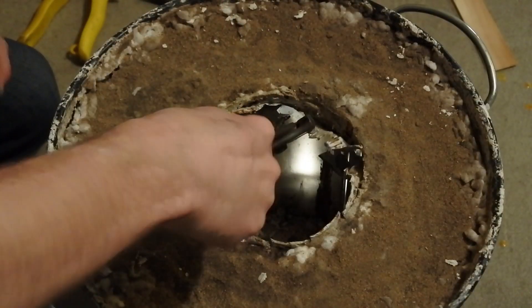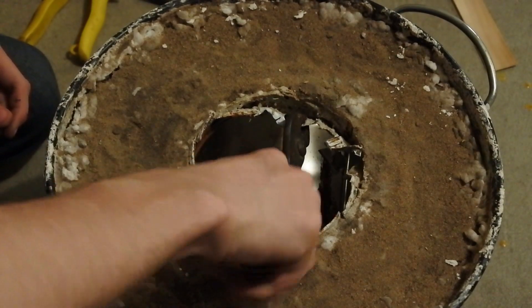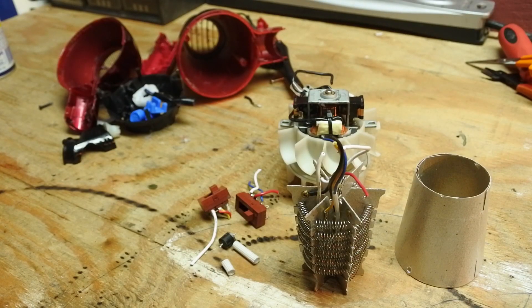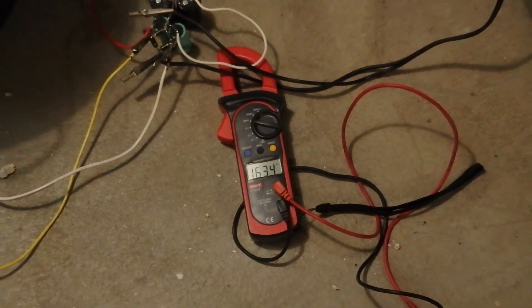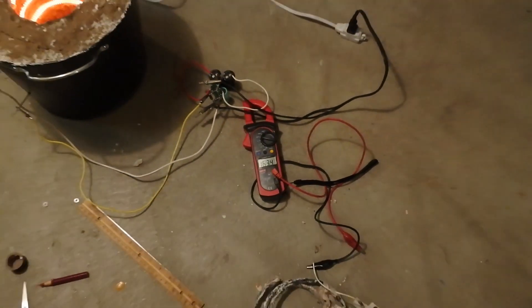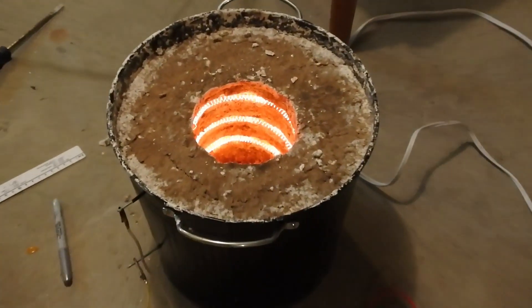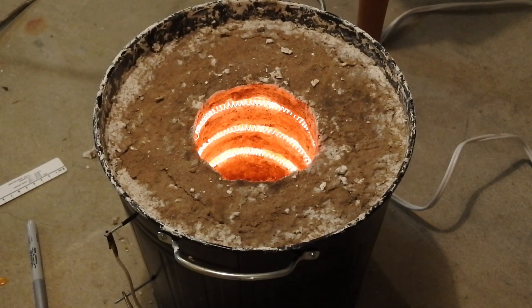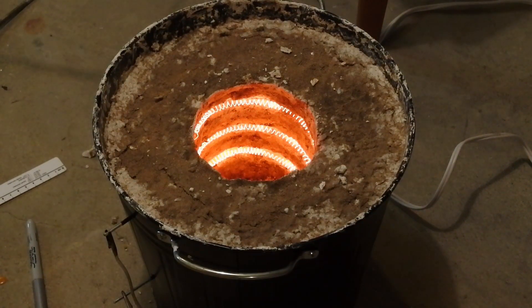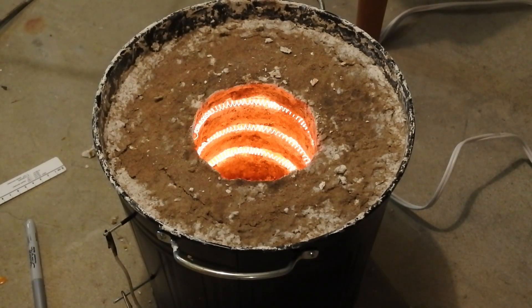In 2017, I decided I would try building an electric kiln to melt aluminum. I took apart many hair dryers and appliances that had heating elements or nichrome wire, and then I casted my own furnace with a 50% sand to plaster of Paris ratio to make the body. I added a temperature controller to this later, but don't have footage of that for this furnace. What I really disliked about this furnace is that over time the inside began to crumble so severely it became impossible to hold the heating elements in place.